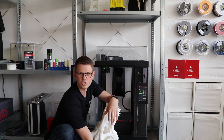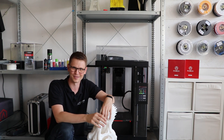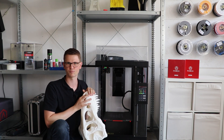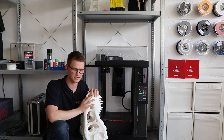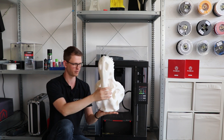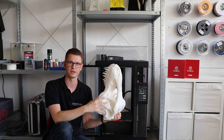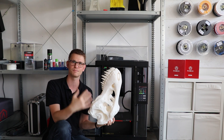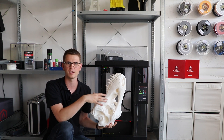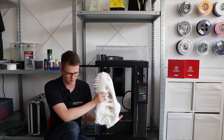Just so I don't forget anything, I've got a little cheat sheet here in front of me. For this T-Rex skull: 158 hours of print time, 1.4 kilograms of final weight — an absolutely massive model. We used the IdeaMaker slicing software developed by Raise3D to slice this, using the speed settings: a 0.25 millimeter layer height, 15% gyroid infill, plus a raft on the bottom.